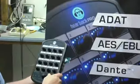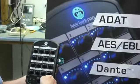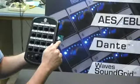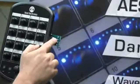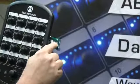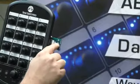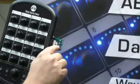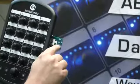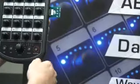I'm going to turn it back this way so we can see these LEDs. There are four LEDs along the side here. When I plug the power in, you're first going to see a blue power LED come on, followed by a yellow run LED. After the programming takes place, it'll change from a yellow run LED to either a green done LED or a red error LED. If you do get an error, the best thing to do is pull the card out and plug it back in, or you can unplug the RJ45 and plug it back in.